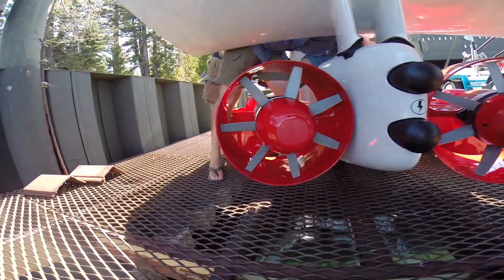Because the Dragon's pulling downwards instead of upwards like a normal drone, everything works backwards underwater. That means if you tilt the Dragon forwards it goes backwards, and if you tilt it backwards it goes forwards. So you couldn't see anything when moving forwards — that's not going to work. So the Dragon's electronically stabilised to stay perfectly level underwater, and it's got an extra two props on the back to move it forwards and backwards and turn it around.